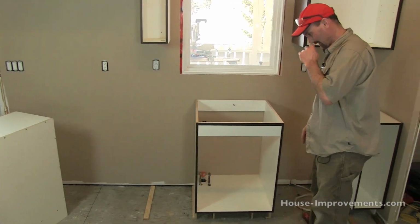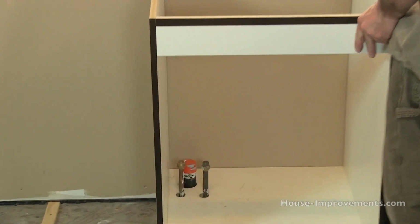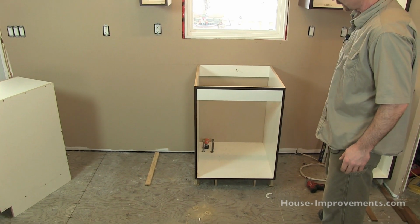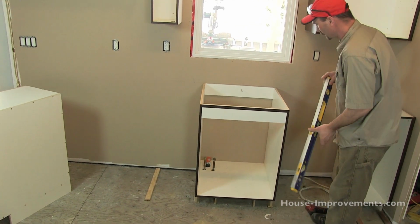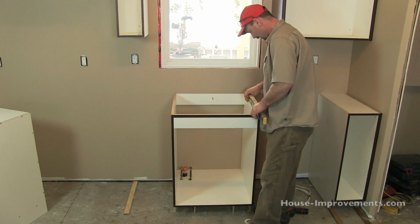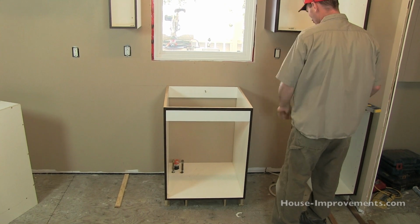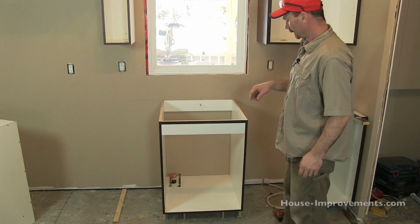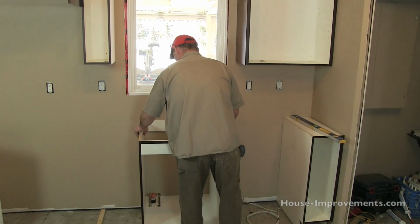Okay, so you can see how that worked out there. I'm just moving the cabinet over to where it should sit. So that gets our pipes all nicely in there. And since I've got it sitting there, I'm gonna see how we are for level. We're good that way. Looks like our front probably has to come up a bit again, yep. And I've got a plumb line drawn on the wall, so that's not an issue. So I'm going to pull this cabinet back off of there. I can put some glue around those pieces for the heat duct, and then I can set it back in.